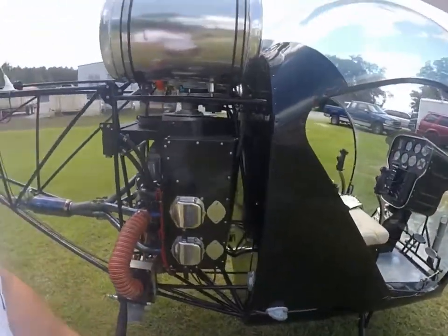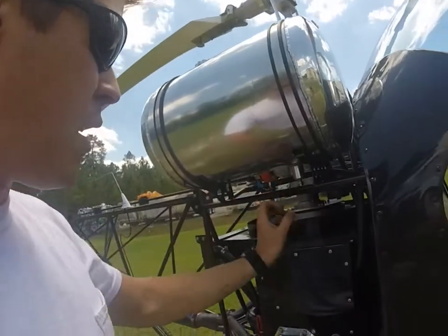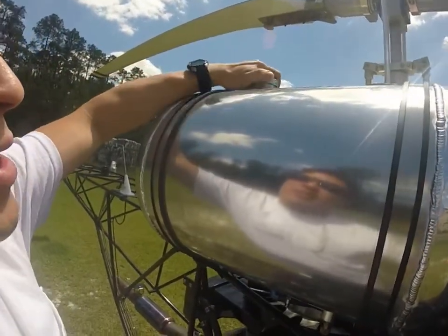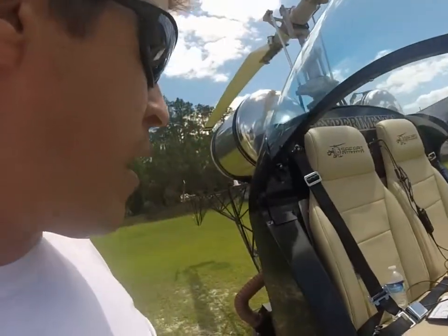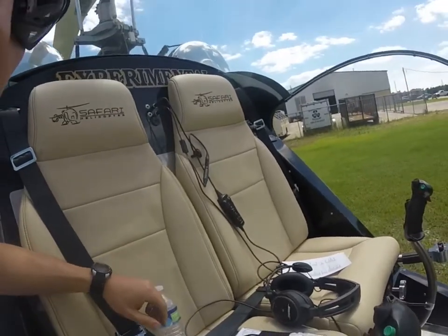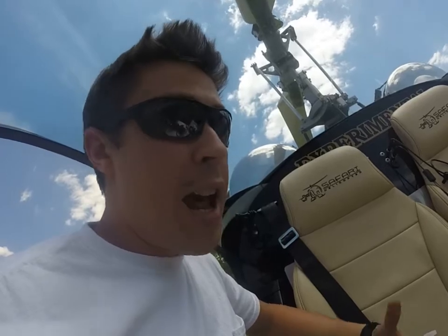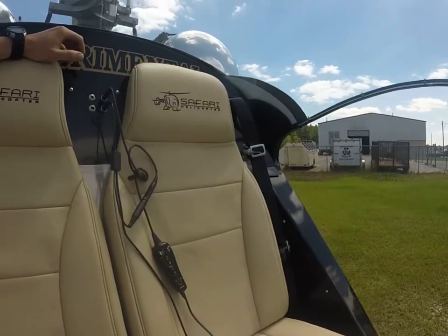Check and make sure your wheels are off if you're not flying with wheels. At this point I would check the gas, but I already did that. You have two drain sumps — both tanks have one, and one is on the opposite side where your gasculator is. I will check the cap — and there it was, a loose cap, so I just prevented some accidental spillage. In the cockpit, make sure you've got your headphones and a kneeboard if you need one. Before starting the engine, make sure all the cyclic controls are free, as well as the collective and the pedals — nothing is jamming them up. Go ahead and check your fuel selector valve and make sure it is on.